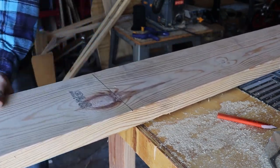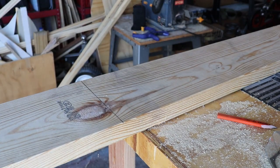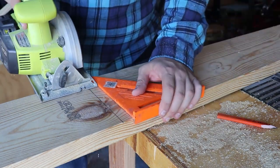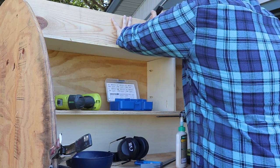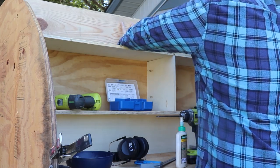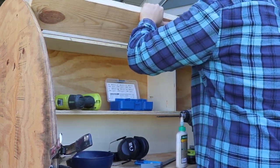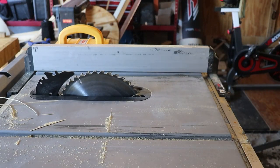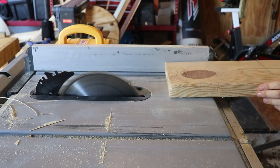One cool thing I did learn on the internet is to use a speed square as a straight edge for using a circular saw — that's kind of what you're seeing me use here for one of the first times. Here you do see me dry fitting this into the position that I wanted it to, making sure it all fits before I take it back to the table saw. I did go ahead and cut an angle on top of the board just so it kind of matched with the curvature of the camper itself, so I just set the blade for whatever degree it seemed to need and shot it through.